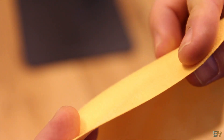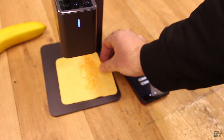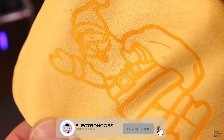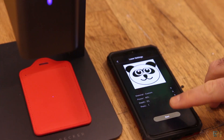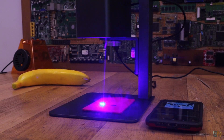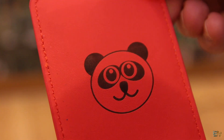Let's start with this fabric — it looks like some sort of silk. I start at low power so it won't go through. Using custom settings I was able to get good engraving results. The same goes for the grey fabric. Next I tested it on some red leather — I engraved a panda logo with a bit more depth. Setting the depth to a higher value makes the process slower because the laser travels slower to achieve greater depth. The results on leather were good, though the depth was set a little too high. You have to play with the settings to get the best result.